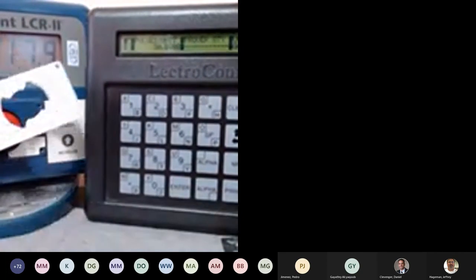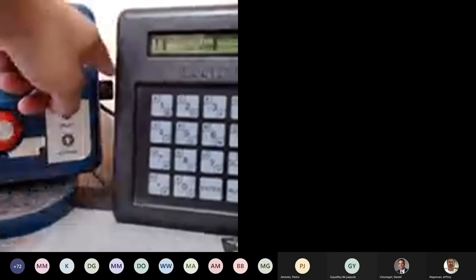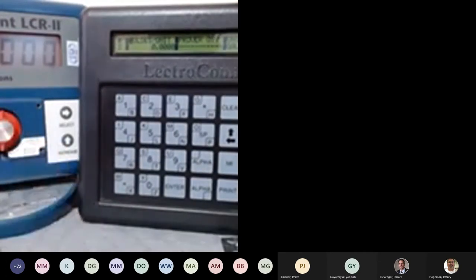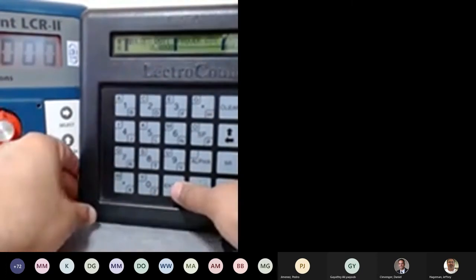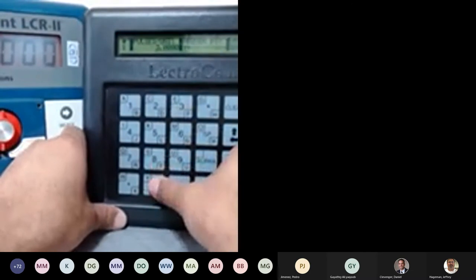So that means if you are in the product calibration especially, you must remove the plate. To be able to remove the plate, you have to break the seal from the side door, from the switch plate. That's the only way. If I flip the switch here, now I'm on the 6 o'clock position, and bring the cursor, take a look here: now my P is flashing. Now I can press Enter and I can enter my K factors.